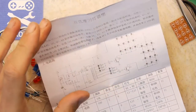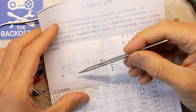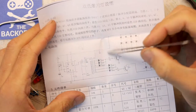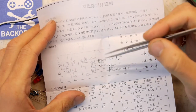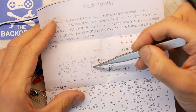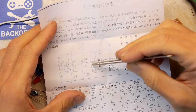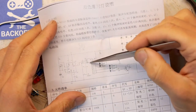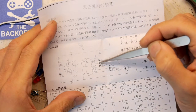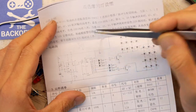I'm just thinking. Just bear with me on this. I know we're in the middle of the build, but look. The 555 timer is triggering this, right? And every time this 555 timer pulses, it's going to switch. This is like a decade counter. So the first pulse will be on zero, second pulse one. So if you've got these chained together, when it's on zero, if you've got the diode here, it can power through, drop this down, and these two other diodes are stopping the current from this going back into this chip and probably causing this to get confused.